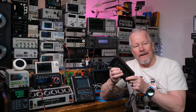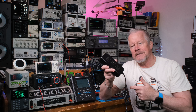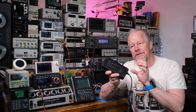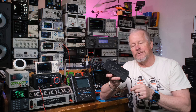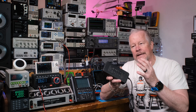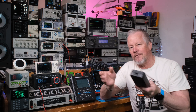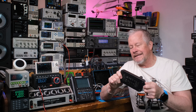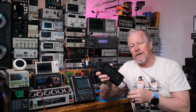I bought some of these to power up some Class D amps and I was kind of bummed out because the input section was the classical low-frequency switcher — the commutating diodes creating big pulses of current as they turn on and off, charging up a bulk capacitor, and then there's a switching power supply, maybe a flyback or something, regulating the output voltage. I even got an LLC supply that still had the traditional low-frequency switcher in front.